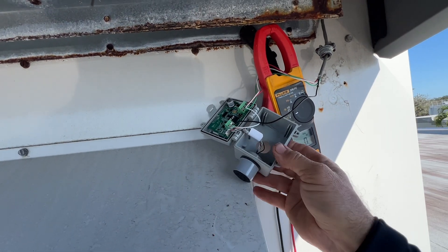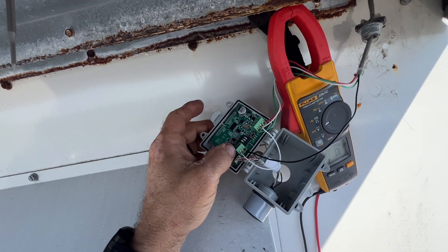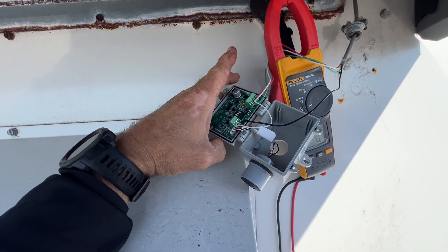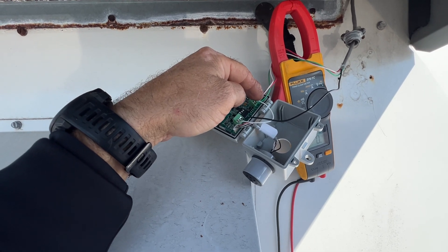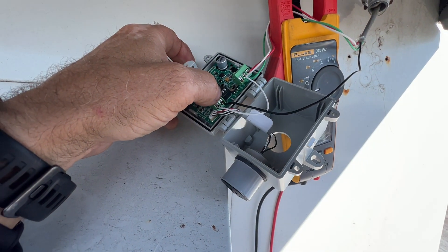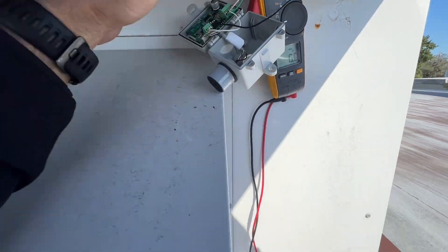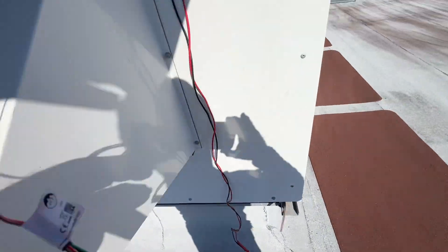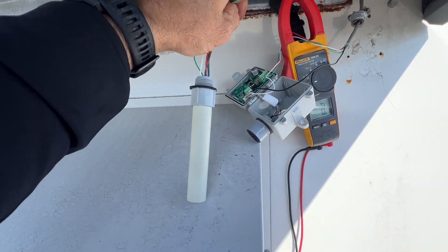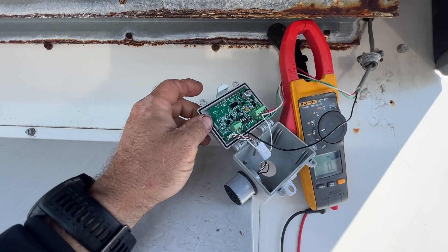All right guys, so there is one kind of a big difference — the temperature sensor on this controller is integrated. Took a little head scratching to figure out what they wanted because the wiring diagram was not clear at all. Ended up having to run the jumper from common to the sensor, and our feedback to the controller on the other side. Where before they had this into the Wago connector on a green wire with the white hooked to the common — the only difference is just packaging and less wire. It would have been nice if they showed the jumper on the diagram.